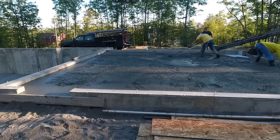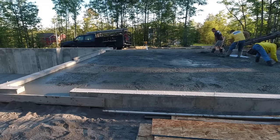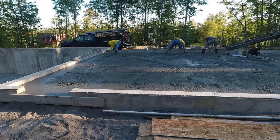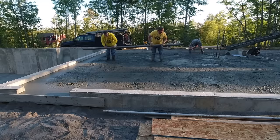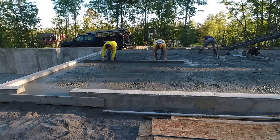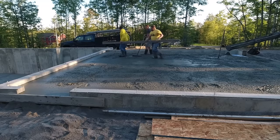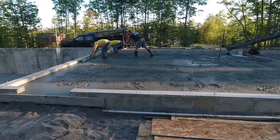Not having me run the chute leaves me to mag float the edges, which is what I'm doing now — it's kind of a 50/50 thing. Darren and Luke are just puddling the concrete, getting it raked out as close to grade as they possibly can to make screeding as easy as possible. We're going to wet screed this — kick screed it today — no power screed, no vibra screed, even though we could use that. The pour is relatively small, and Darren and I have been screeding together for over 30 years. With a 14-foot screed, you can see how easy it is with two guys when they have the same motion.